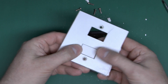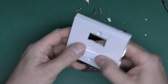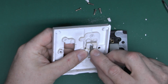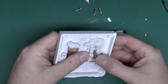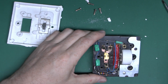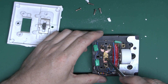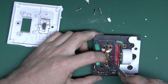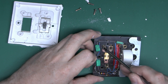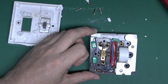So that's the on and off switch — just a pivot mechanism inside the plate with a cutout hole for the rolling knob. It's a standard spring piece on the back that goes down inside onto the contact piece, so it's either connected on one side or the other when pressed — a perfectly standard type of switch.